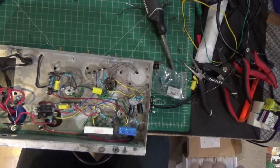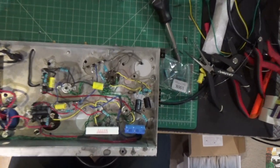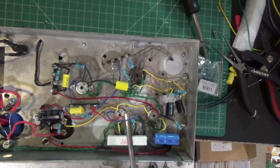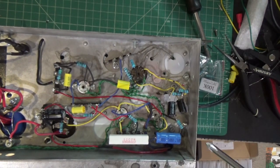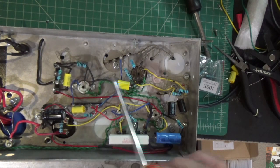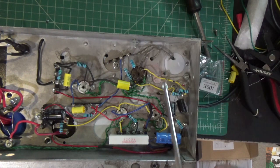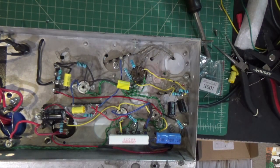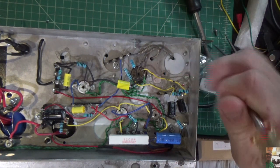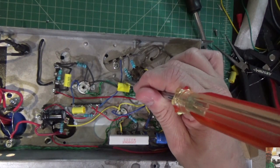Let's take a look under here one more time. I have this big wire that I need to trim — that goes to the output transformer. That's way too much wire flopping around in there. We're going to just continue to make this thing a little more compact and neater. There's no issue around the inverter tube. Remember, everything's around the 12AX7. So by making these direct connections and not having all that stuff sit on top, I'm basically shortening the antenna — shortening the microphone. That's my plan. And now I'm able to tuck these wires down low where they belong, and I think we're going to get a much cleaner build.